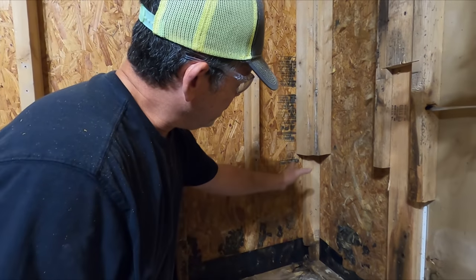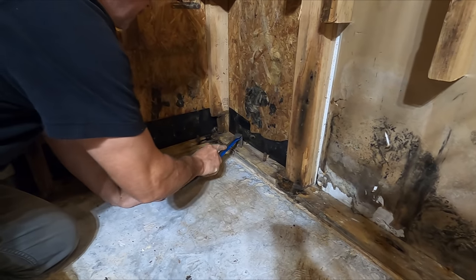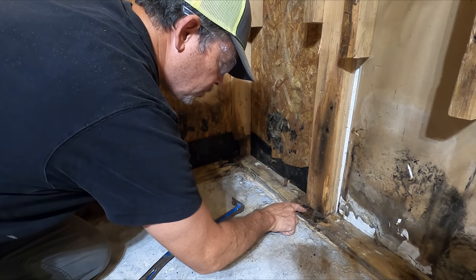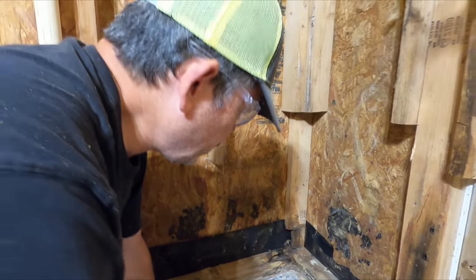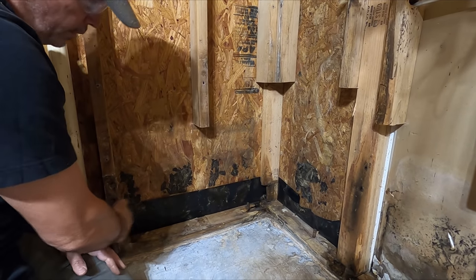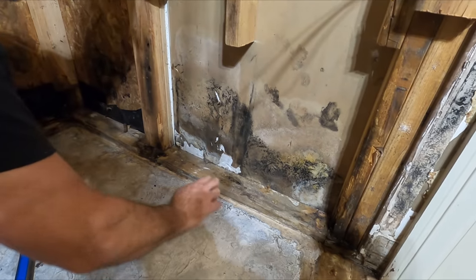All right guys, we've done all the rot cut out of the studs, so let's check the sills. This one is pretty good — really good — and this one's fine. We do have a little rot on the sill plate on this exterior wall, but it's just right here on the end, so we're not going to try to repair this. On this one it's fine except for about four inches on the end. So what we're going to do: we're going to leave these, go out to the saw, and cut a new piece of pressure treated to go from here to this outside wall, overlapping this one. We'll notch it so it fits underneath, then put a new one on top of the existing.